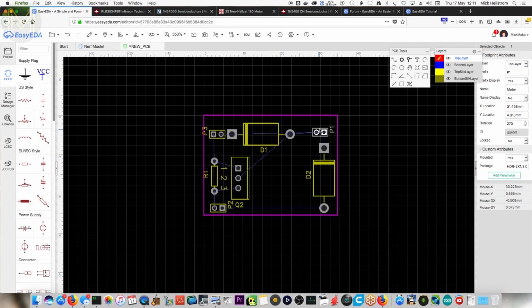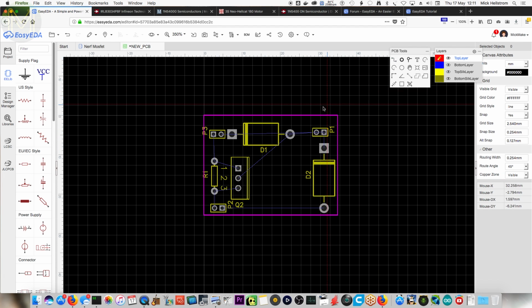So I'm trying to get to that little PCB option up there. So I want to get from here, and then... Now see how it's a really tiny track. You want to make it as big as possible because it's carrying current. Yeah, 40 amps. You want a big, chunky wire, and because you've got two layers, you run the same track on both sides.